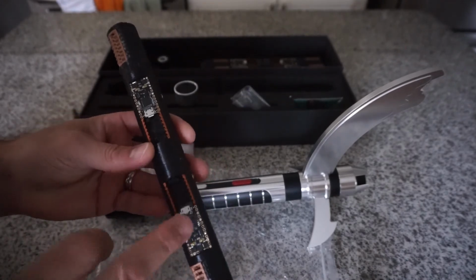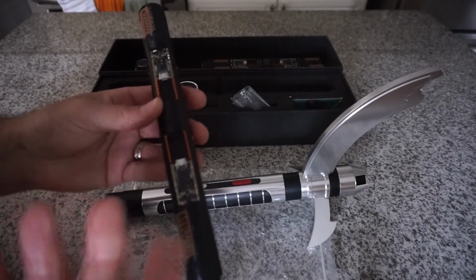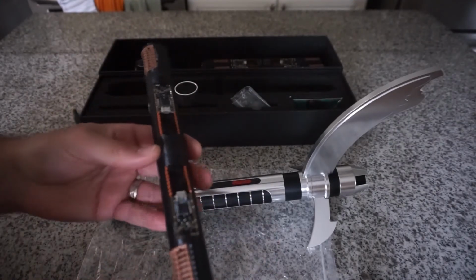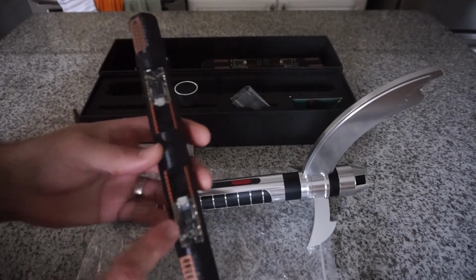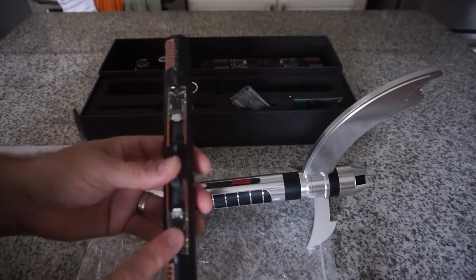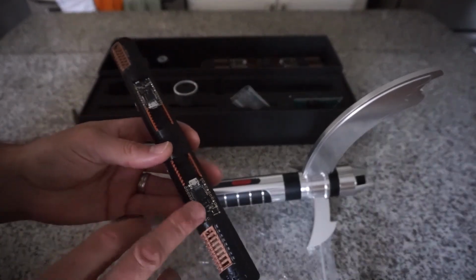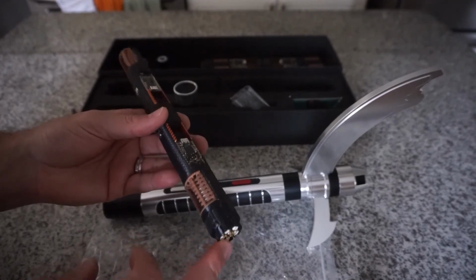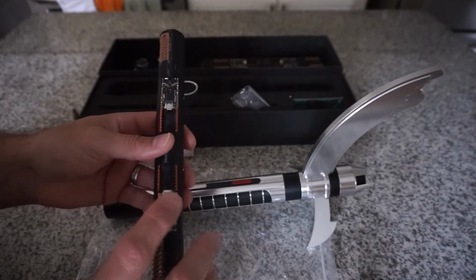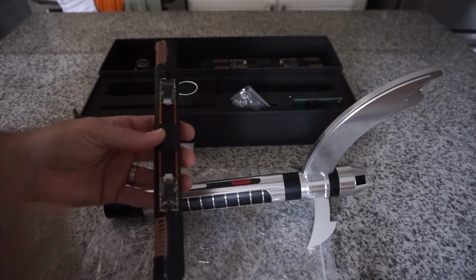I think I then went on to explain, again, the config files. If you're feeling like you want to change something, please go on the SD card. I have the version of ProffieOS, which is 5.9, that I used. It has the config folder. Use what's on the SD card as a starting point, because it has the correct pad assignments for the crystal chamber and the main blades, and the right data pads that I've used. If you don't use the config file on the SD card as the starting point, you're going to mess it up. Of course, I always keep a backup.